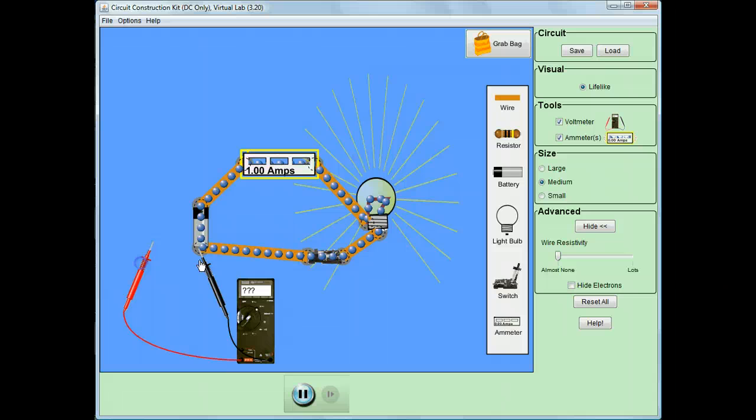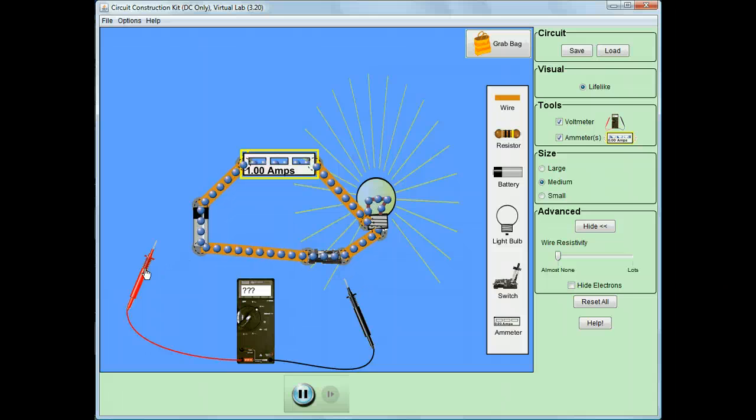We've dropped by 10. If I reverse these around, the voltage drop is negative 10. And it's just saying that you actually are climbing up if you go from this end to that end. So we have a minus 10 versus the plus 10, depending on how we do it. Now remember, the wires have no resistance.